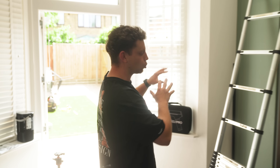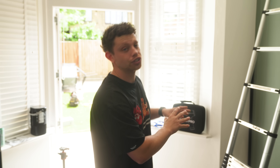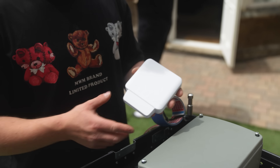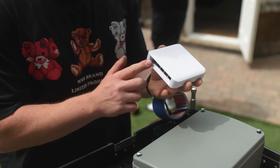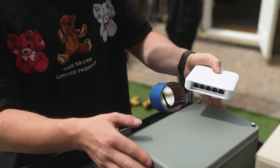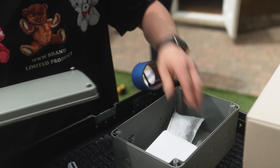Now comes the tricky part — we need to get the drill out. We could do a wireless bridge between the switch we want outside for the cameras and the main router, but it would always be best to run a cable. So we're going to try that first. Here's our flex switch — we're going to take PoE in and get four more ports out. This little device is going to live inside our weatherproof enclosure.